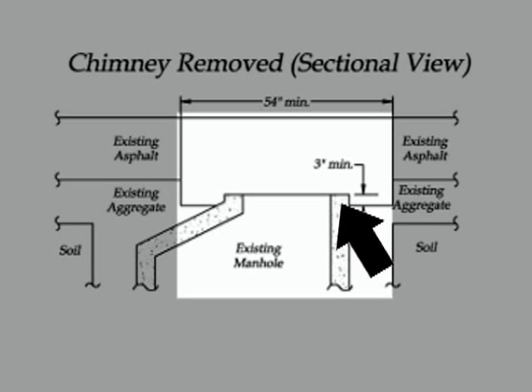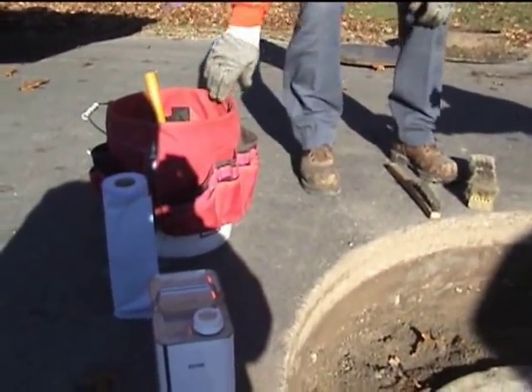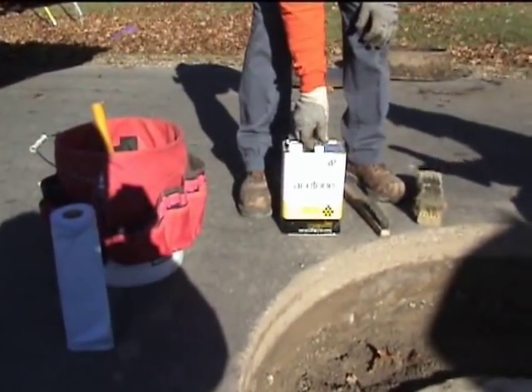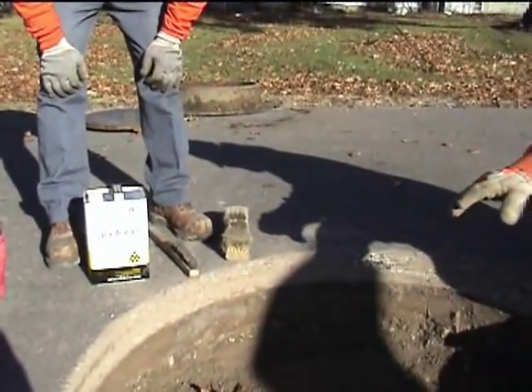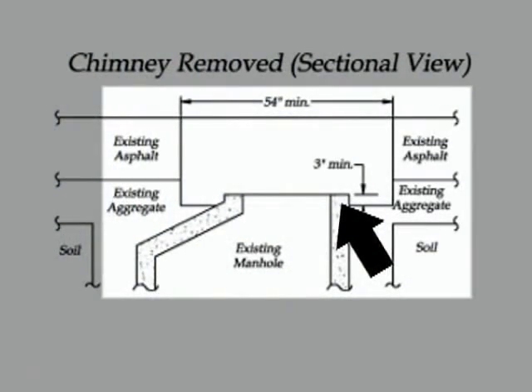At this point you need to clean the concrete. If we're dealing with precast concrete, make sure none of the old sealants that bonded the previous rings, or mortars, or any residues are present on that cone. Wire brush it, use acetone to clean it up real well, wipe it down with a clean rag, and make sure it has no humps or dents. Then we'll start our rebuild.